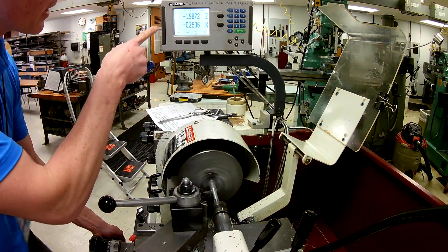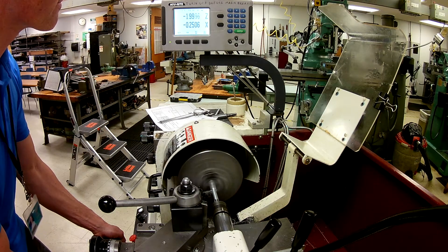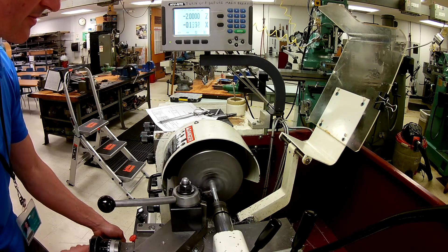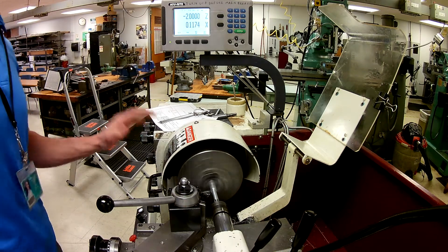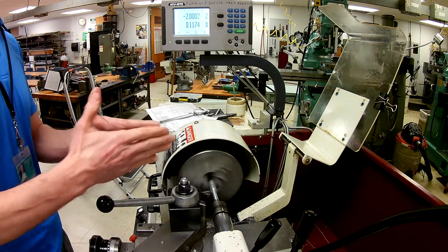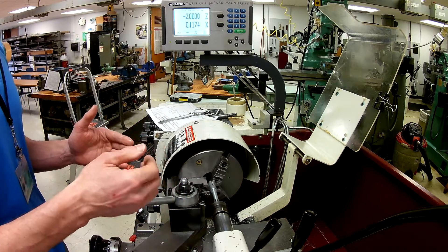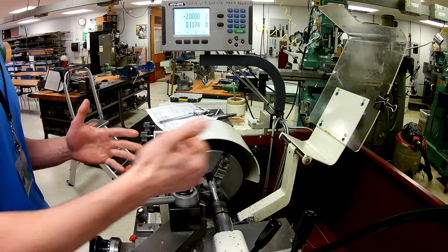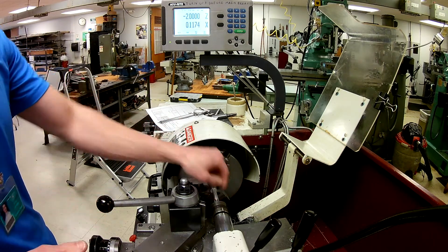I'm watching my number up here. You should have immediately noticed that I actually took some material coming out that way. That's because the way the tool comes up against the part, it's not necessarily cutting every single spot, so it's leaving grooves in there. Now they're all cleaned up — you have a nice clean surface right there, and it's definitely something that you should check.